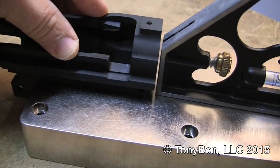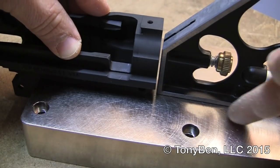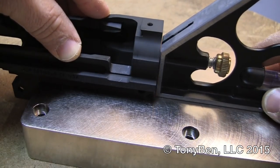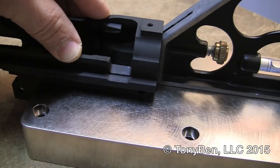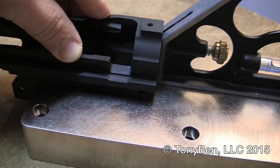Now again, if you happen to be lucky enough to have access to any kind of precision flat machined piece of steel or a slab of granite, you can also check the perpendicularity of your receiver face. And this one here is just beautiful. It's spot on. There's no daylight that you can see, so this is a perfectly perpendicular receiver face, and it's going to ensure that when you screw your barrel on, it's going to go on straight. It's not going to be cattywampus from the center line